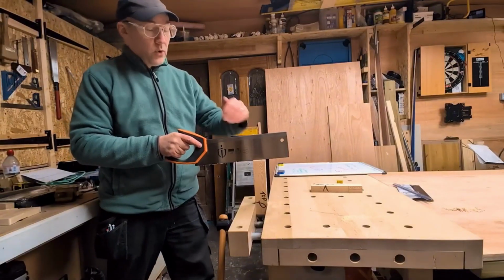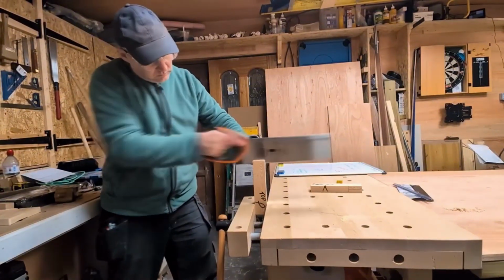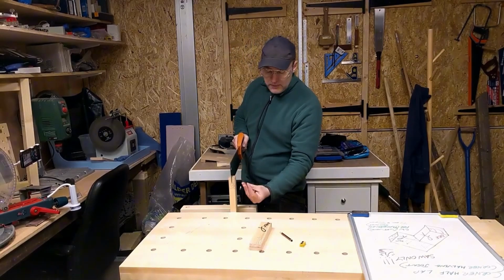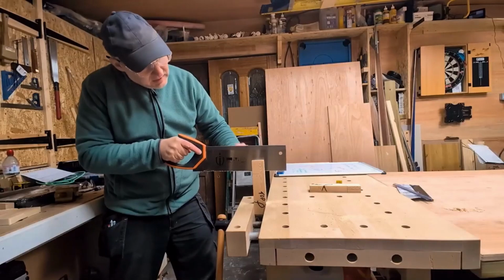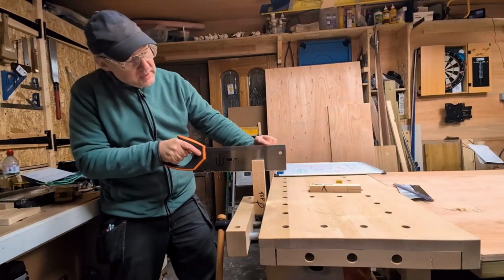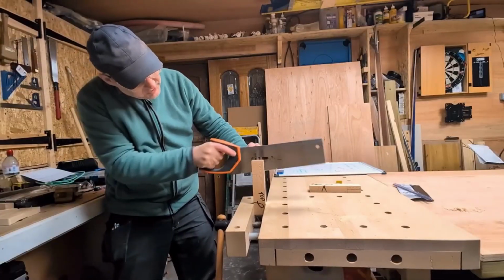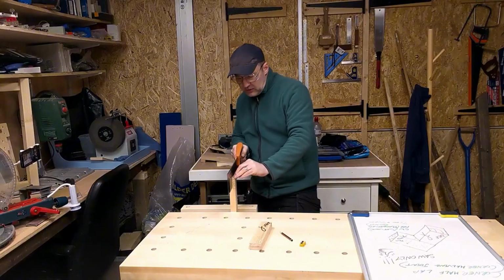So this is your step 4, cutting right down. This is a rip cut. The tenon saw will do a rip cut because you're ripping down through the grain. When I get to the bottom of this, I want to keep this level. Then I should be level on that bottom line. But when you get closer, is when you want to check it out. Now, we're nearly there. We don't want to go too far.